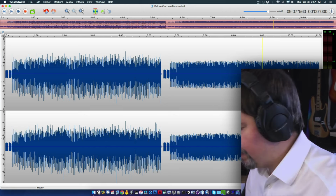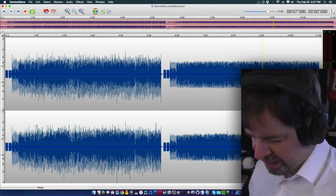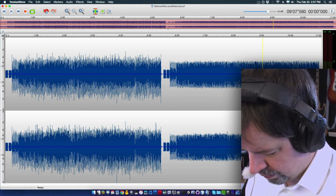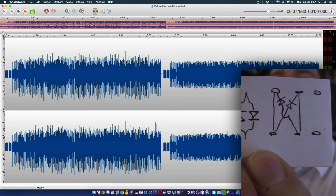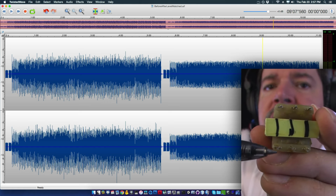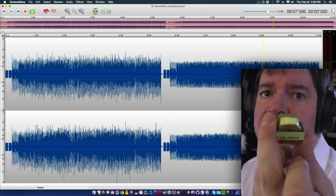All of the strange little strips of paper, but it's good for drawing waveforms. I would send in a sine wave, kind of like that, and wiring it in this configuration. And remember, there are long wires that are just going from this point to this point, and they are the windings of the transformer. Basically, I can just run signal through here because it's nothing but a wire. I'm using the coil. It's about, I don't know how many ohms, about 600 ohms of impedance. This is a telephone coupling transformer.